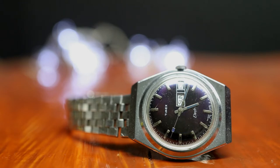I want to point out something about the basic Timex design — it has been used throughout several movements, such as the Timex Dynabeat, which is a version with an increased beat rate. The Timex Q-Quartz, which in the original version — not the reissue — is an electric watch with a quartz regulator bolted on. There are also variations that have a GMT function, and possibly more, as Timex used the basic movement prolifically, probably to save money on design and production.